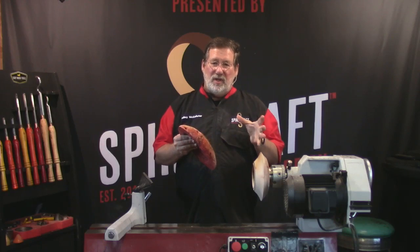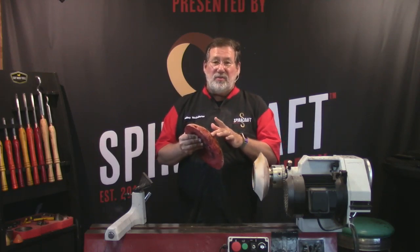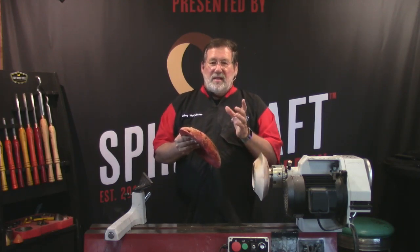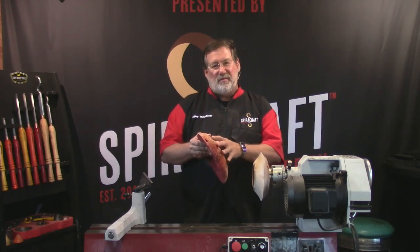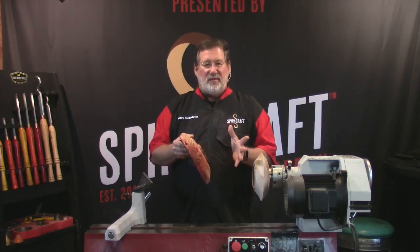Submerging it does it all at once, in theory. Packing all the holes with a gel resin, it's the same resin but in a gel format, is more tedious, but you don't cover any of the rest of the piece. Again, I'm going to return the whole piece after the resin, whichever way I go, so I'm not worried about it being covered in resin.